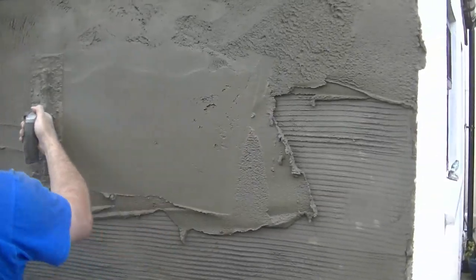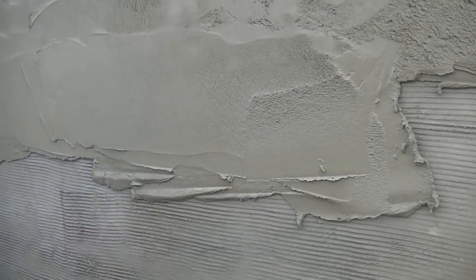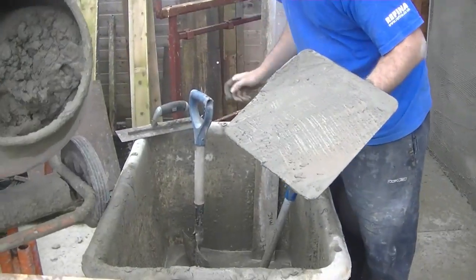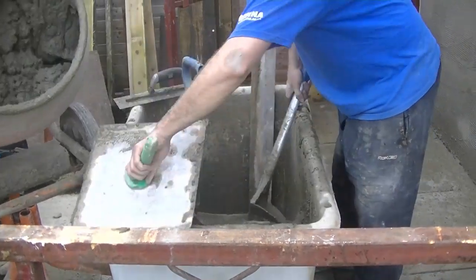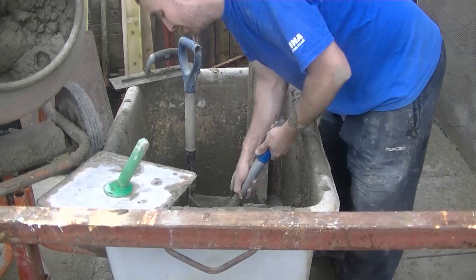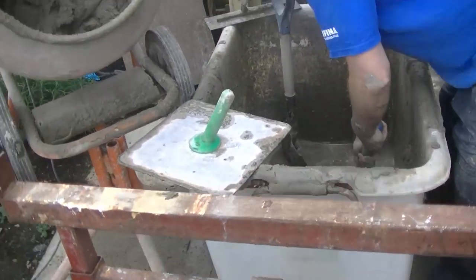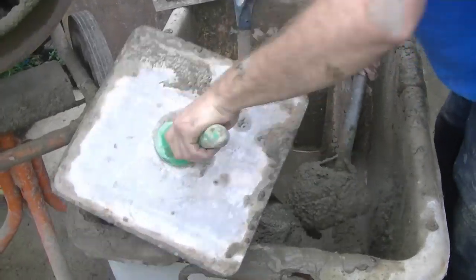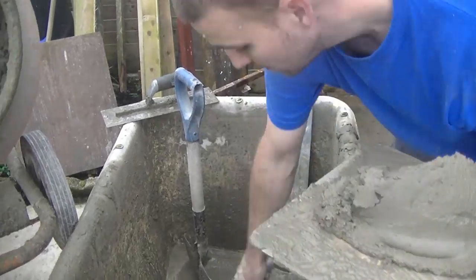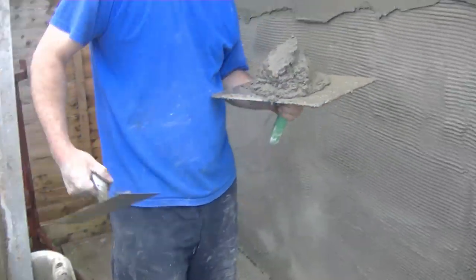I was going up, up and then going across to neaten it up. You can see how neat it is at the top of my coating there compared to the bottom. What I do — especially when I have the top straightened — is put a wee band along the whole edge just to keep the joint in as quick as possible. Even at the bottom of the tub where it may be a bit stiffer, it's easily mixed up with that Refina bucket scoop.